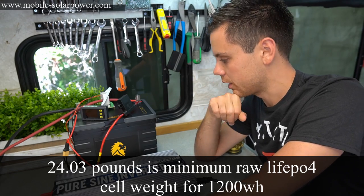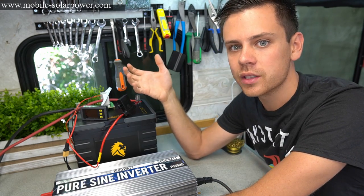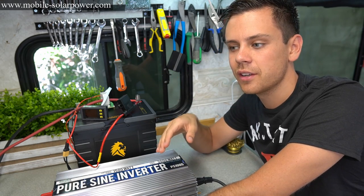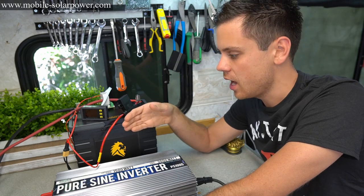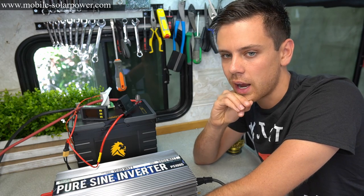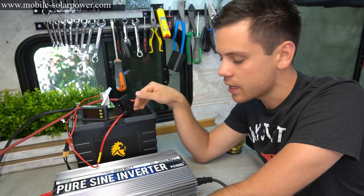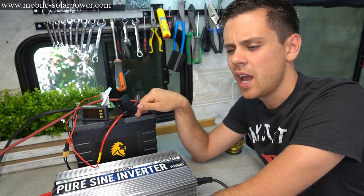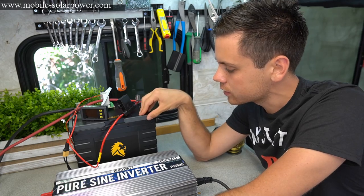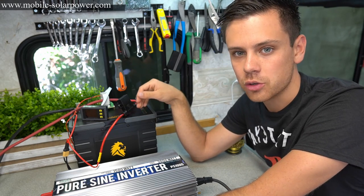It's physically impossible to do that. I also just asked the company about their lifetime warranty — some people thought that really means forever. I know some of those lifetime warranties only cover the lifetime of the product and not your actual life. They said it's 3,500 charge cycles or 80% capacity. So whether it takes 10 years or five years, they guarantee you'll get 3,500 charge cycles. I asked how do you tell how many charge cycles you have, and they said the BMS has a charge cycle counter, which they use with capacity data to determine if there's an actual failure.